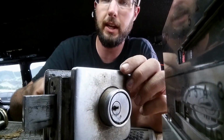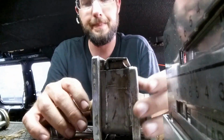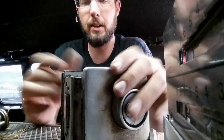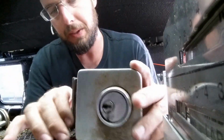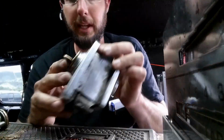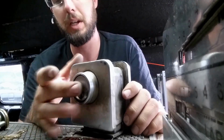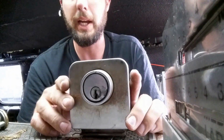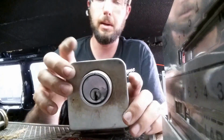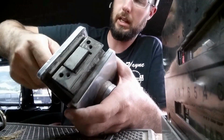So this is like a gigantic deadbolt insert that goes on a commercial door. But there's nothing to take it out, and the cover plate here was like welded into the door. So this thing has kind of been a bear so far. It looks like you've got a conventional thumb turn mortise body with a conventional mortise, like an aluminum door, Adams Rite thread-in type of lock. So it opens, it closes.